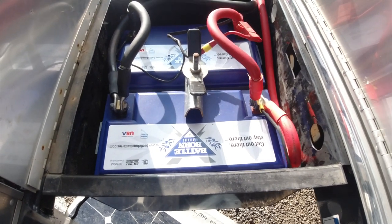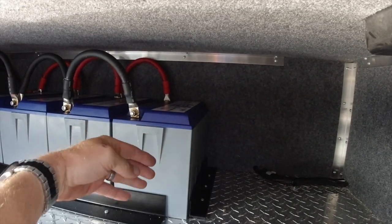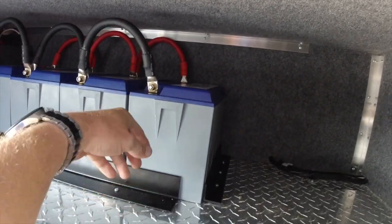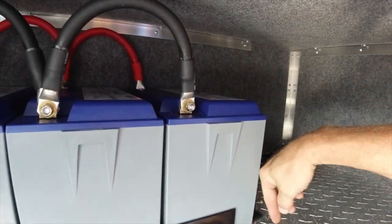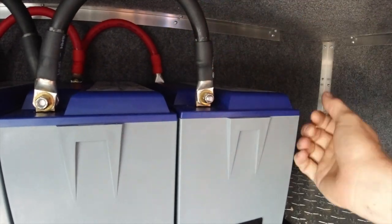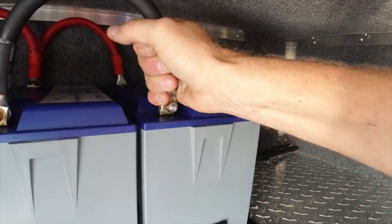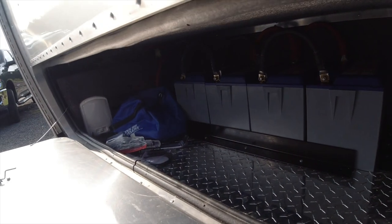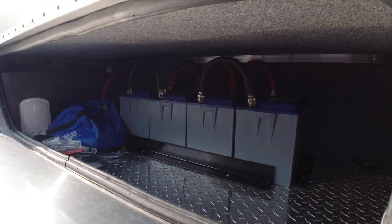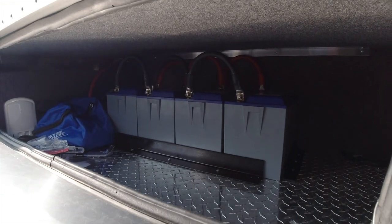We'll have to make that change. I'm probably going to move these two batteries into the main battery bank so we'll have all six in here. I'm going to take up this flooring — and the batteries are secured with angle iron, but they're not actually fixed in. I can literally pull them up. I've got to get them strapped in, then wire the battery bank correctly, and then go inside and look for more issues.